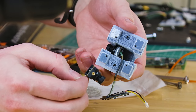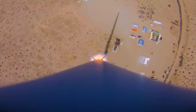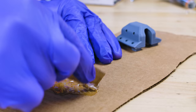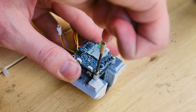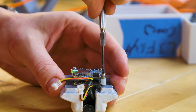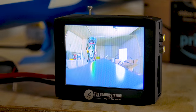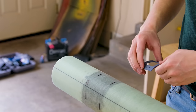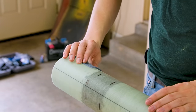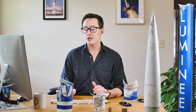Next up moving up the vehicle is the camera housing. I used two RunCam Split 4s on the outside of the vehicle — I love these since they're so tiny, very low profile, pretty easy to use, and the quality is decently good. I designed and 3D printed the housing for them to go in, but was a little concerned about the integrity of the print, so I coated the whole thing in two-part epoxy. The housing holds one camera looking up and the other looking down, with the boards and SD cards on the back. The down-looking camera was also connected to an FPV video transmitter, which sort of worked. I then painted the housing with a few coats. To cut the camera hole, I designed a jig to draw out the profile I'd need to cut and printed it out, cutting out the hole in a test piece of airframe first, just in case something went wrong.